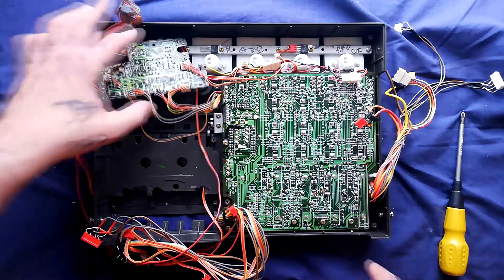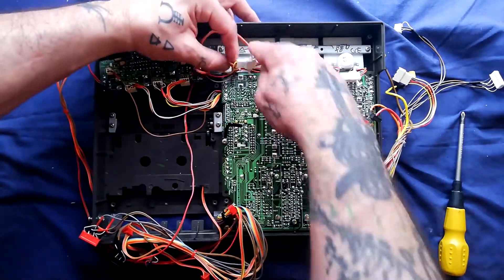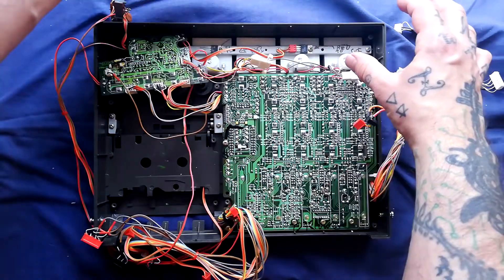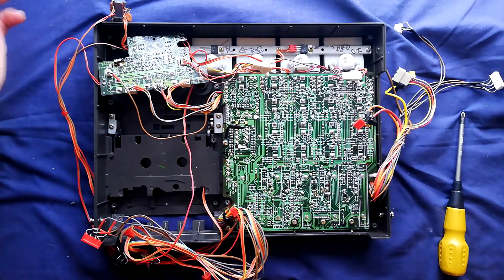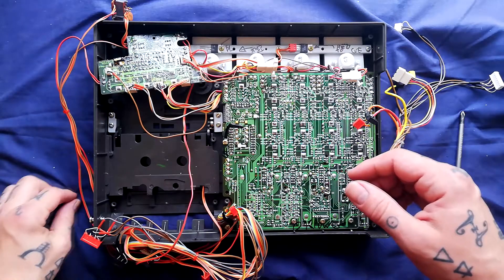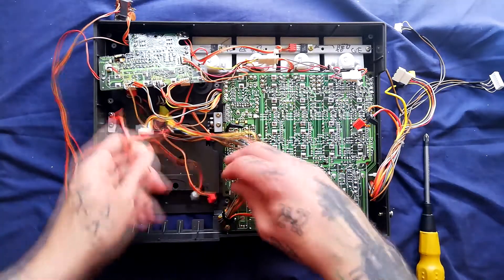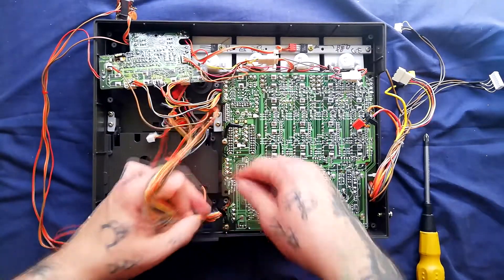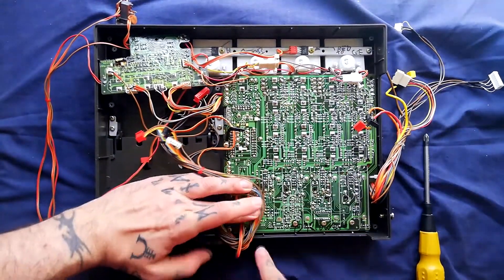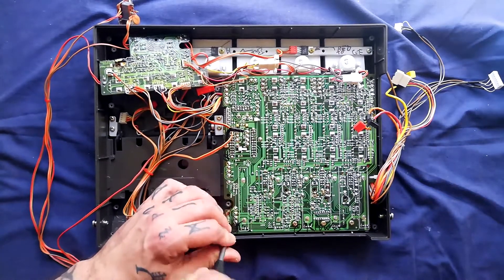Before I unscrew this mixer, this brings me to the other construction variation I've seen. Here you can see that the cables coming from these analog VU meters and running into the mixer have little connectors, so you can have the meters and the mixer completely separate when you deconstruct it. Just be aware that on your unit it might not be like that. Like the knob variation, I don't know which came first. Notice also that there is a cable tidy in this corner, just to stop the cable coming out and preventing the case from shutting. I've written in sharpie 'C/T' for cable tie to remind myself that it goes there when I put it back together.